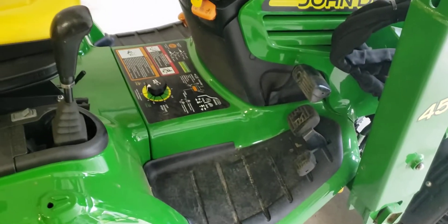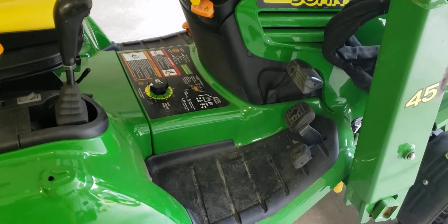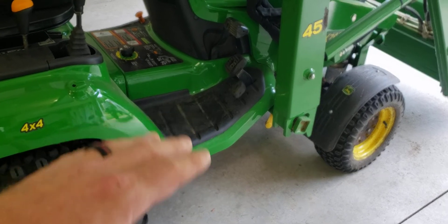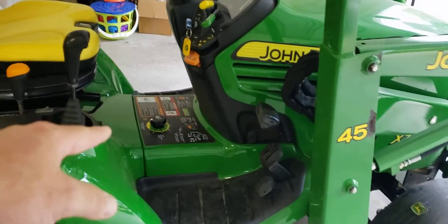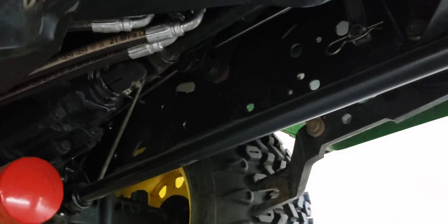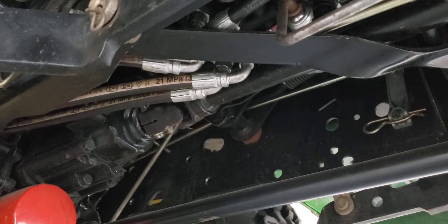If you're not running a mower deck and never going to again, there's room under there. But I have the 60 mid-mount blade for this thing, so I have a ground clearance issue and I need that spot for the gearbox. So I mounted the two-spool hydraulic valve underneath the mower deck height adjustment box underneath the tractor — where those 90-degree fittings go up, that is the spool valve. It is just jam-packed under there with stuff from Deere.